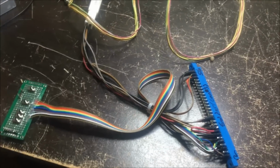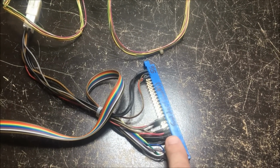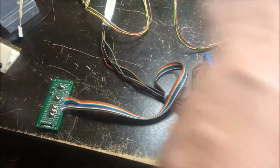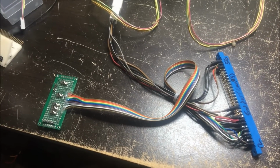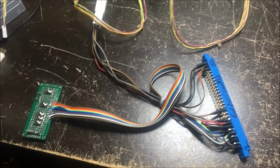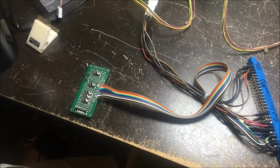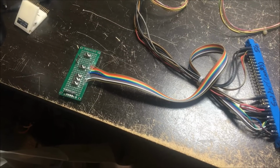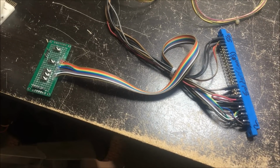Okay, really quick, I did go through and did a continuity test between the two blue signals coming off of the edge here, and there is no continuity between the two blue signals on here, so it is a board problem. So I'll hook back up and look at the schematic and go over it. So we got blue data from the top monitor going to the bottom monitor as well. It shouldn't be going to the bottom monitor, but it is. So I've got two blue signals mixing together, I think, is what's going on. So I got my regular blue for the bottom, and the blue for the top is also on the bottom. So I'm getting way too much blue. So at least that's what it looks like is going on. So we'll look into that and find out what is going on.